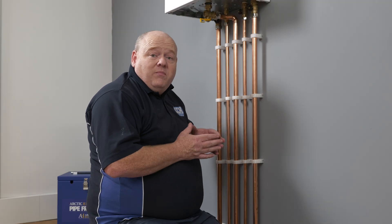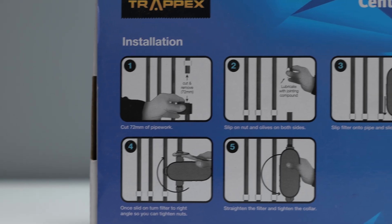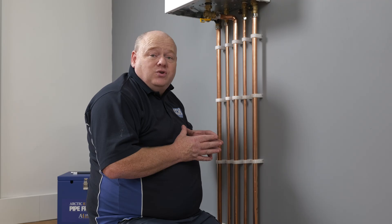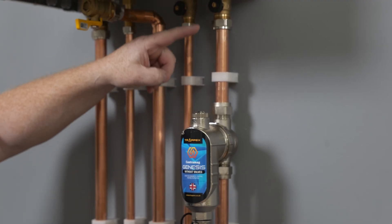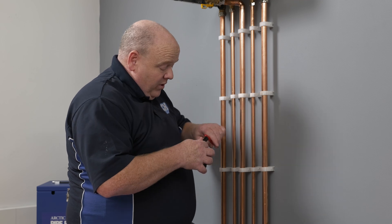Now we check it just to make sure that it is drained down. If you've got a pressure gauge, just have a look at the pressure gauge — we don't want any nasty surprises when we cut into the pipework. Also, if we look on the box, it's got a detailed diagram on there showing you how much to cut out. We also want to make sure we've got the correct clearances above, so if we've got to take the magnet out afterwards, we've got the clearance for that.